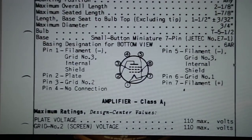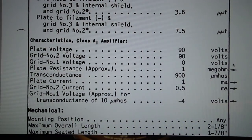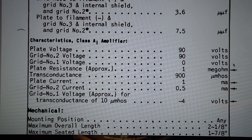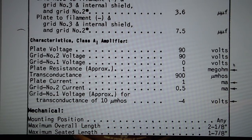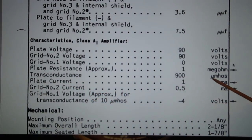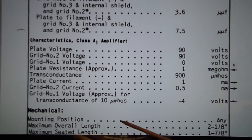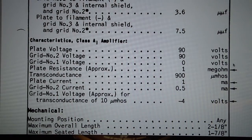The thing I'm going to be focusing on is the specifications — or in this case, characteristics. I explained in a previous video that every tube has a certain amount of transconductance, but if you have too much or an excessive amount it could be not so good either. The transconductance on the 1U4 is approximately 900 micromhos — that's just a measurement of the transconductance of the tube. This is about the average characteristic transconductance in a 1U4, but we're going to use a different tube.